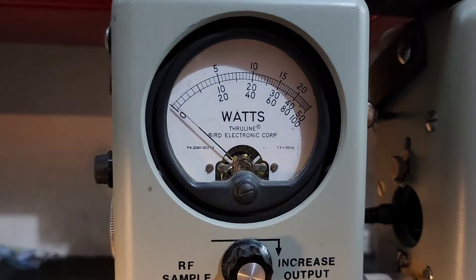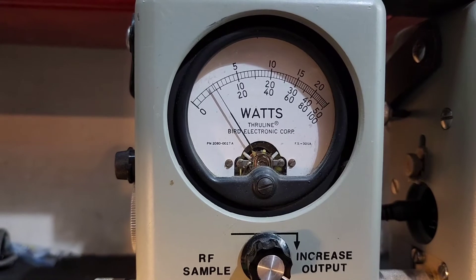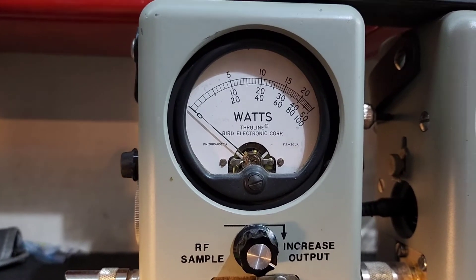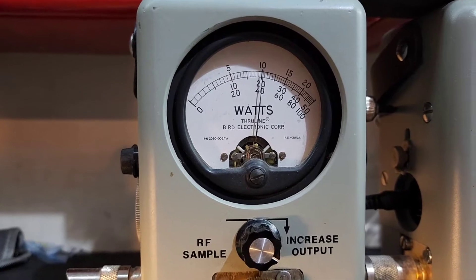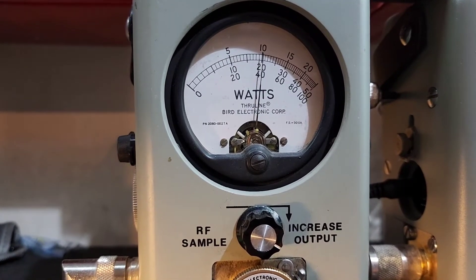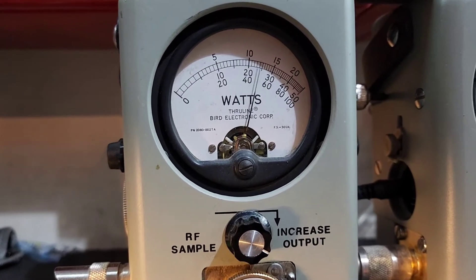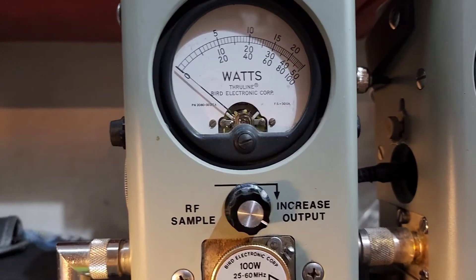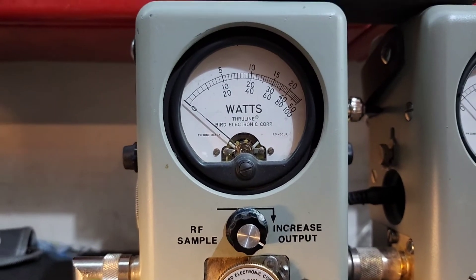I'm going to start with the RF power all the way down with the 100 watt slug. Got you about 5 or 6 watts all the way down — that way if you decide to run an amp, you have enough adjustability. 40 all the way up. Showing average power swing, floating around 78 to 82 — we'll call it 80 bird.